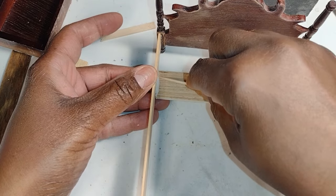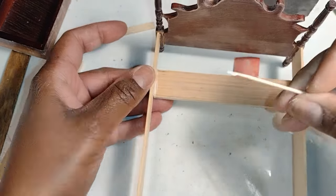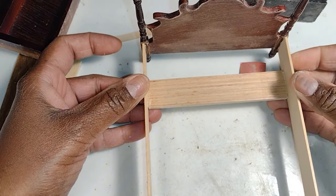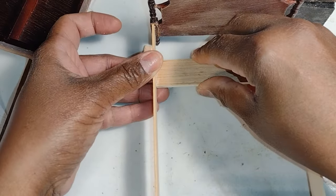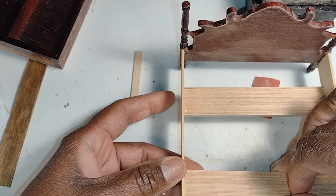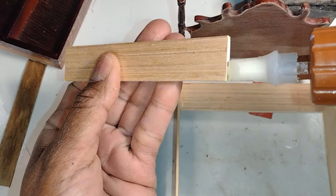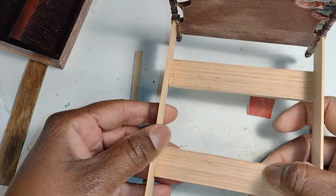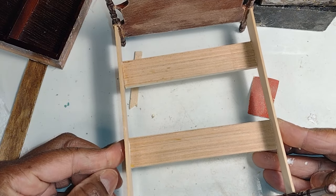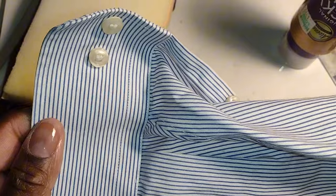I just had to hold them in place for a second for the glue to catch — it was a really nice, neat fit. When I got done, I cleaned off the excess glue so it would dry nice and smooth with no glue globs. Slowly but surely, I do believe the counseling for excess glue use is taking effect — I am still in recovery and will have relapses, but I do see signs of progress. Always check your fit before you add the glue — that's why I say try fit, dry fit — because trying to sand something after it's a gluey mess is really hard. I put the second slat on underneath to avoid getting glue on the side rails.